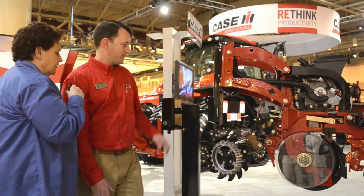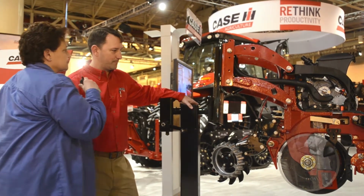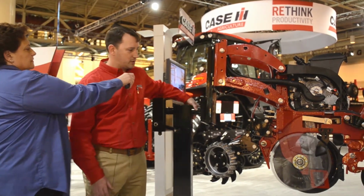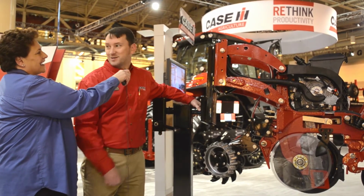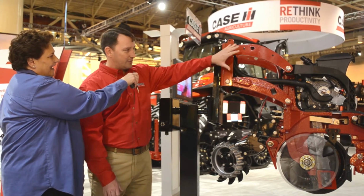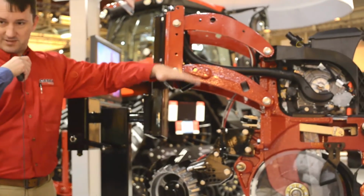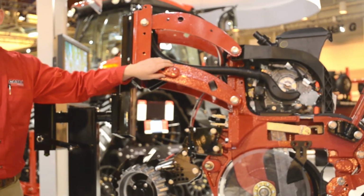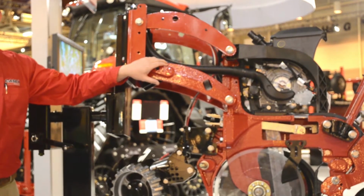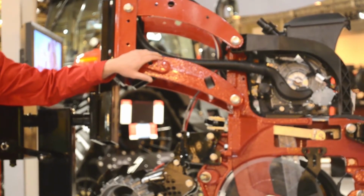Now why don't you give me a little demonstration here, Tony, and teach me on the go what we're looking at specifically here with the technology and the Early Riser Series. Yeah, so I'll kind of walk you through some things, but I tend to think of this as like a hybrid, and there's a lot of traits that make the hybrid. But first of all, you'll notice our new curved parallel links. The bottom one is cast. We've gone from basically 10 inches of vertical travel to 16 inches of vertical travel, which leapfrogs everybody else in the marketplace. Sure. For those producers that maybe have terraced terrain or rolling ground, you get excellent seed to soil contact.